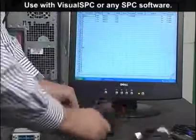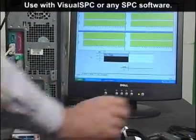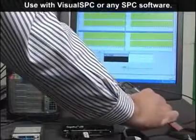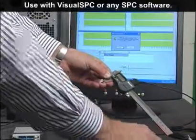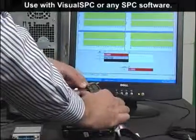So don't give up using your Visual SPC software just because of the cost or because you have USB ports on your PC and the GaugePorts won't work. We configure our GaugeMux USB to work from COM1 to COM4, just like the GaugePorts.